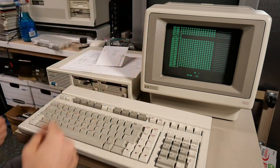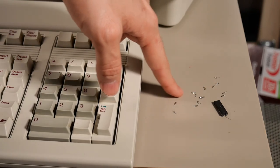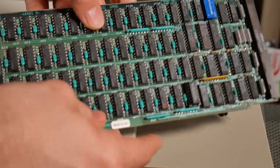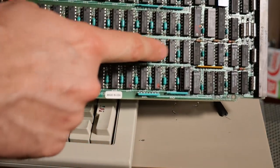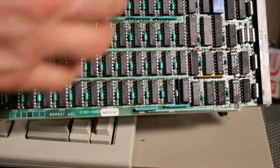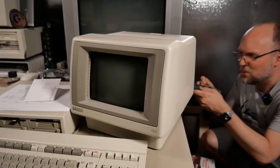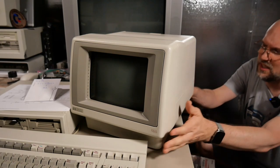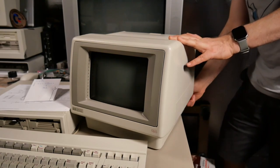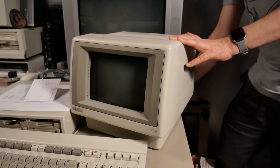Here's the bad chip that I cut out, and the pins I subsequently pulled out. Here is the replacement chip installed in a socket on the board. It was pretty hard to pull the ground pin — there's a really chunky ground plane on this board with obviously very good quality copper that wicks heat away so quickly. I ended up having to use hot air to heat up the board to get that pin out. There's plenty of clearance, so there would be no reason HP didn't socket all those chips — maybe it was a reliability concern, since sockets can be more unreliable long term.